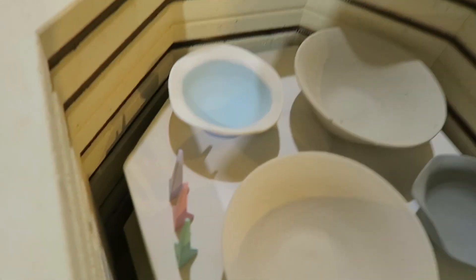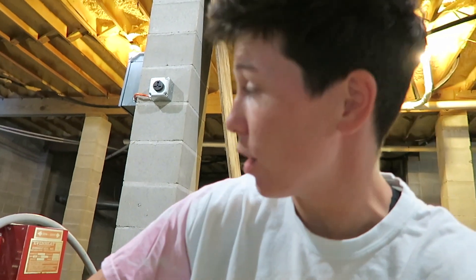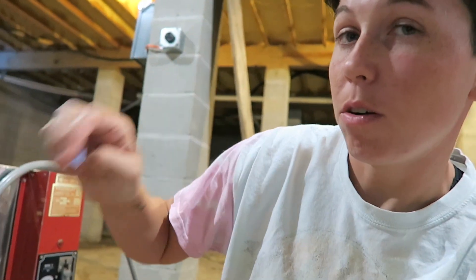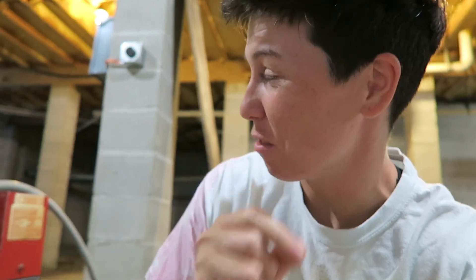Alright, so the kiln is all loaded. I added some cones right there — those self-standing ones. If you guys saw my bisque video, this extra layer used to be on top, but it was pulling too many amps and tripping the breaker. I took that off and reattached the lid. So we have a smaller kiln, but it should be hot enough because the top part was preventing it from getting hot enough.